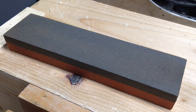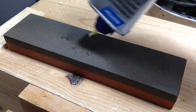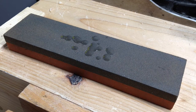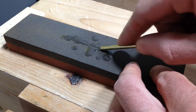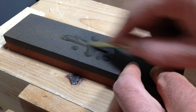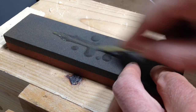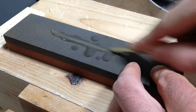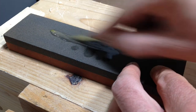I took a piece of brass of the appropriate length and brought it over to the oil stone. Using the oil stone I just needed to make four facets on one of the ends, and this was going to serve as my reamer. This is a little bit slow going, so you could also start it off by using sandpaper and then switch it over to the oil stone to get the final finish.